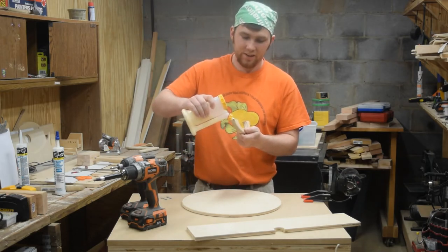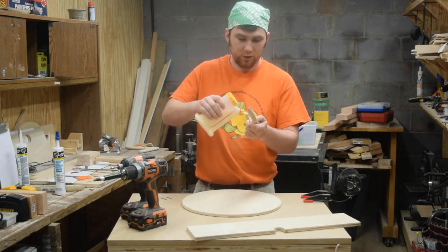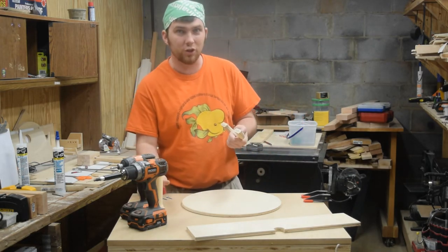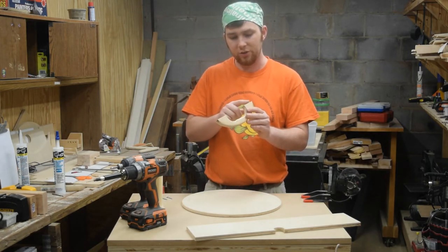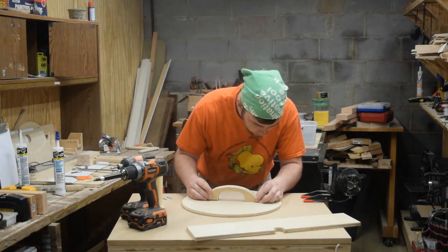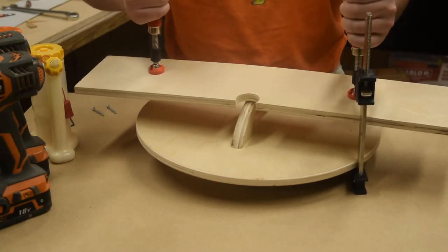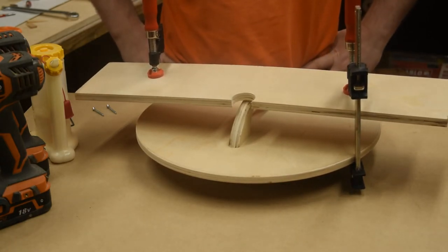This handle, on the other hand, does need a screw in it. I tried it as a test to see if glue and clamps would be strong enough, but when I applied a little bit of sideways force, it just couldn't hold up. After I get this glued and clamped, I'm going to drive two screws in through the front, and I've already countersunk for those. It can be a little interesting providing clamping pressure on this handle, but I think this will do the trick, and the screws from the front ought to help.